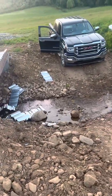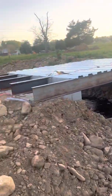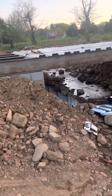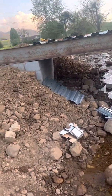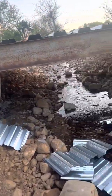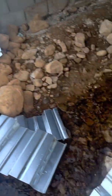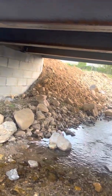This bridge is 14 feet wide and 25 feet long. I've got 12-inch I-beams — I bought two from a local guy who had them at his farm, and three from a place called American Steel in Bristol, Tennessee. The beams are expensive, so be sitting down when you get the quote. If I had to do it over again, I'd bite the bullet and get all the same beams.